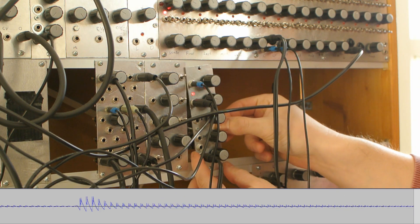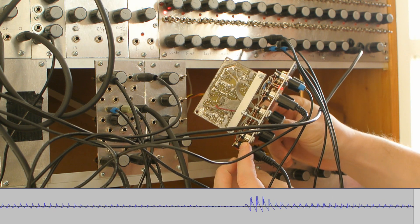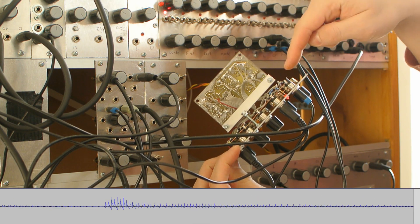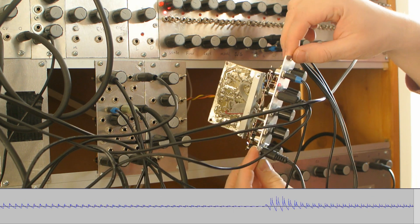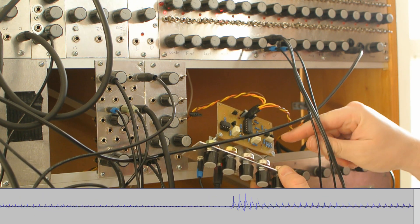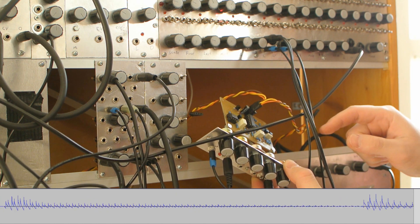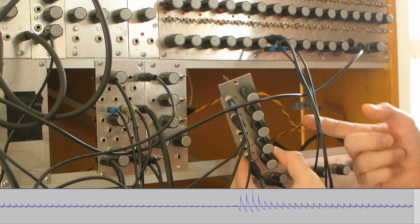This is the ADSR module that I've been working on lately. I decided to make the PCB go in this direction instead of parallel to the main board because it's a little bit larger, and it's larger because I included a couple of things additionally, like an SR latch to be able to latch a trigger signal.